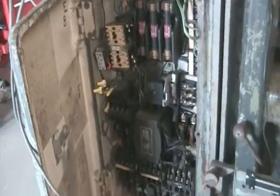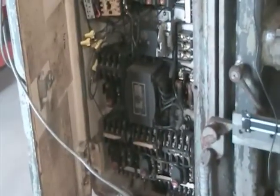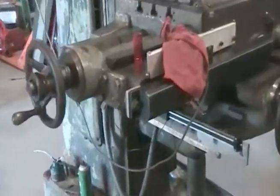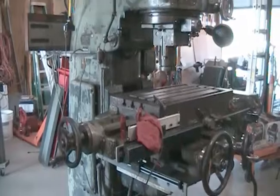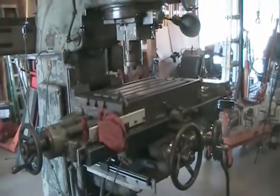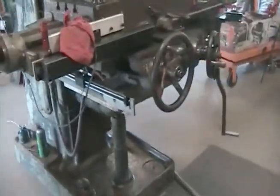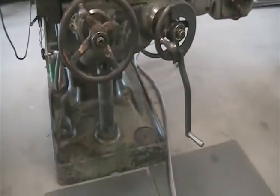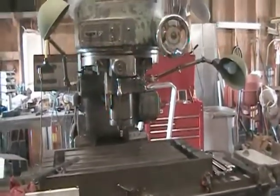This is my 2D Rotary Mill. That's the electrical box. I got a surprise when I purchased it — I thought it was a 240-480 motor setup in there, but when I started working on it, it became apparent that somebody had been in there and changed them all to straight 480 volts. Sort of an awakening moment.